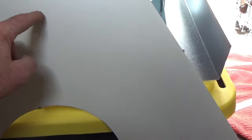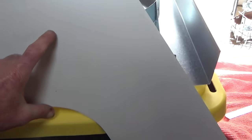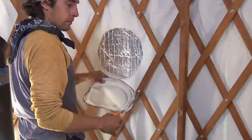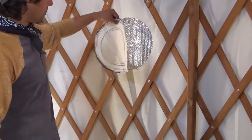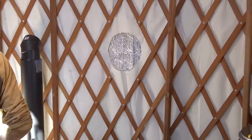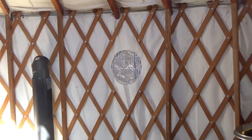The flashing allows you to cut the yurt material two, three, even four inches away from where the chimney is going through, and that gives you the heat barrier you're going to need — because you don't want to light your yurt on fire, that's probably a bad idea. First piece is out, we're gonna cut a hole through here and start assembling the chimney.